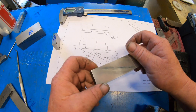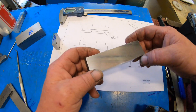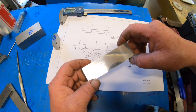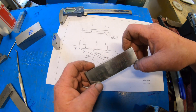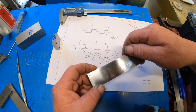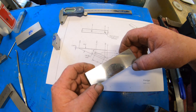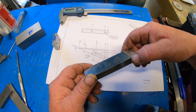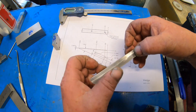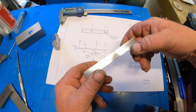I ran over one side with the fly cutter and just gave it a quick rub with some wet and dry, and that's the result. I've still got more to do but I need to get some more wet and dry - I'm getting bad results, still got a little bit of pitting. Very lightly ran the fly cutter over it and just a quick rub with the wet and dry I had. That's the end mill side - I've started rubbing that back.